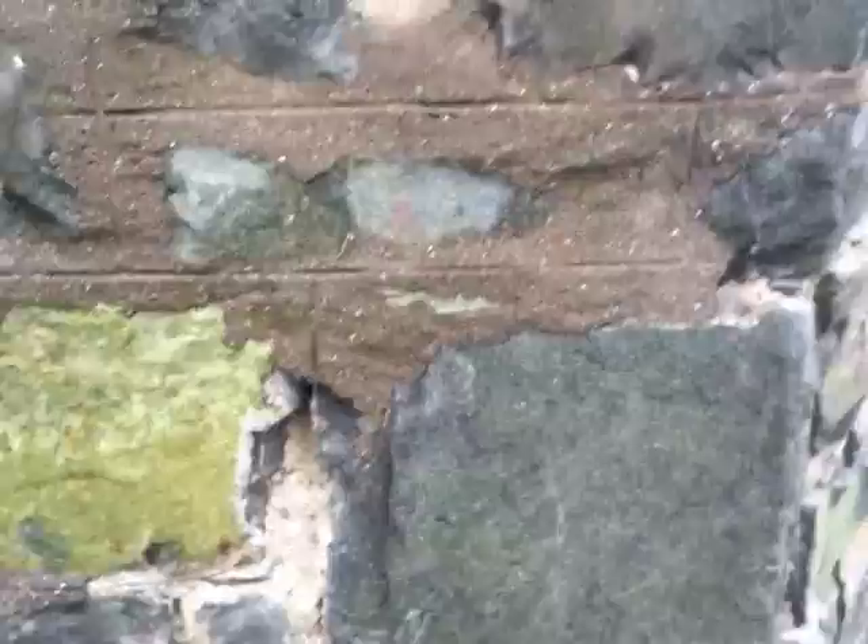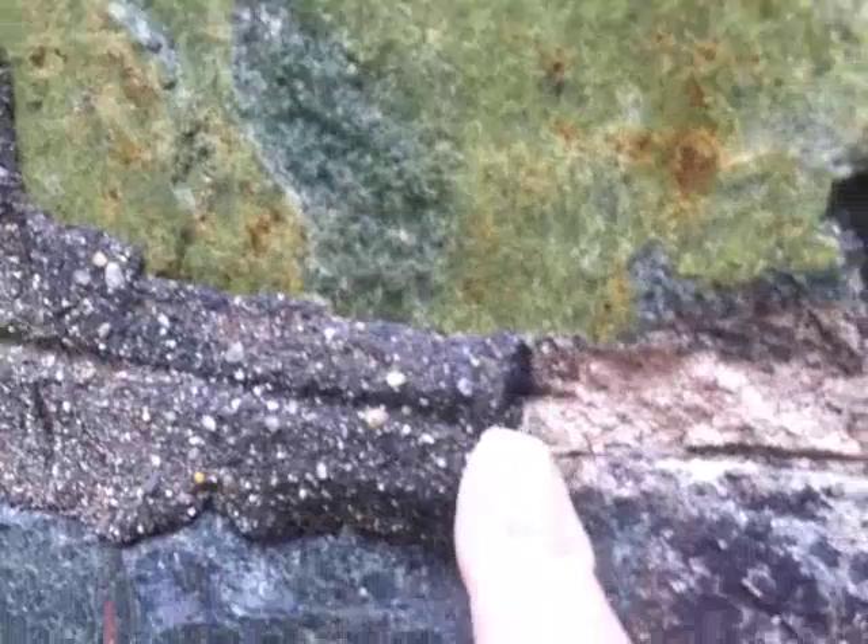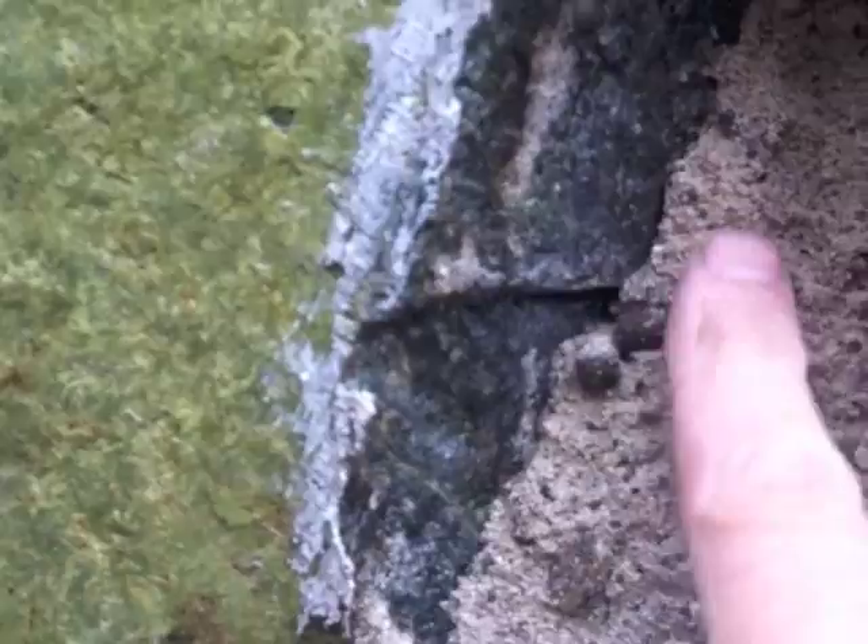At this point the joints are all cut out and washed out as far as I want to take them back. You can see the lime mortar — it's very white — and what they did is they put a skim coat over that of a different mix, and you can see how that is darker. I don't think it's Portland because of the age, but it's possible. It's a very hard mix compared to the back lime mix, so you get a lime really strong — mostly lime in the back — and then the outside is just a little denser.